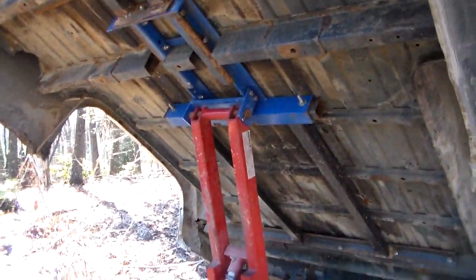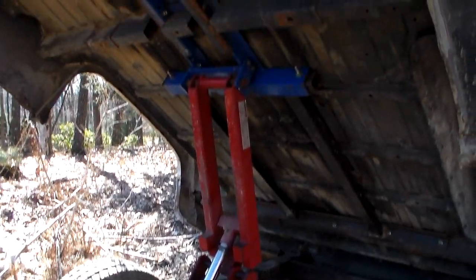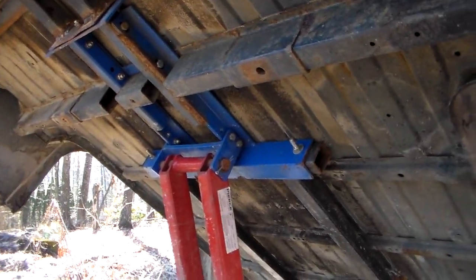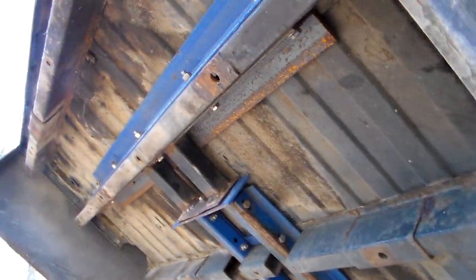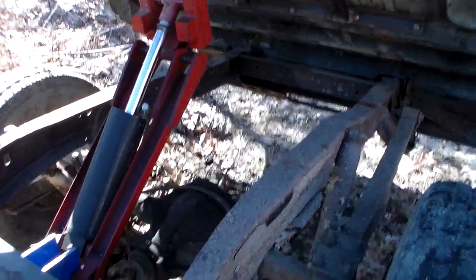When I did this, I measured where the pivot points were on the lifting section of my Super Duty and made sure they were at the same spot on this eight-foot bed. If I hadn't placed them at the same spots, the math would be wrong as far as how much lifting force the kit has. I essentially copied their geometry and I'm really happy with the result.